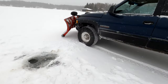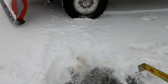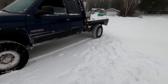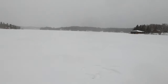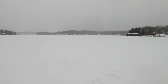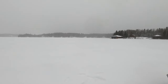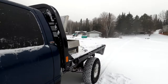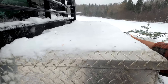It's 8,000 pounds, and 14 inches for me is enough. I did check this ice yesterday — right around here from the shore up to here it's 14 to 15 inches, a couple of spots at 15 inches. I've already checked every 100 to 150 feet up to the job site. Out in the middle of the lake I've got 17 inches. As you get closer to shore you get a little less — it drops to 16 for a long way, and then at the site over there it's another 14 inches at shore. You're always going to get your best ice out in the open, in the middle of the lake.